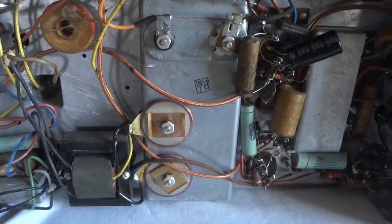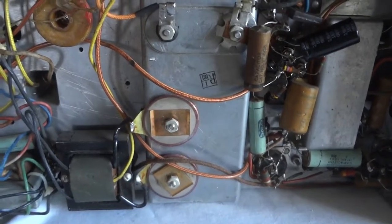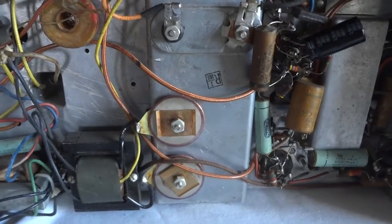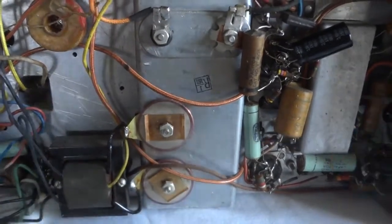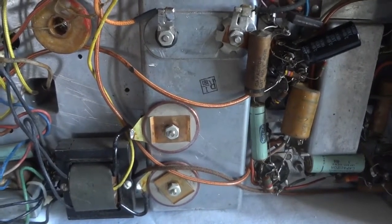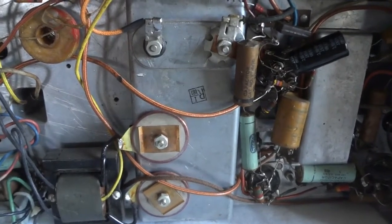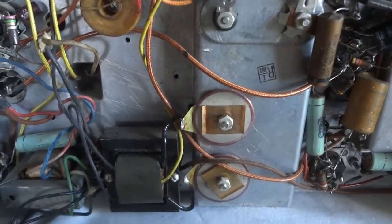This radio needs a 2-volt lead-acid battery. These are very expensive, at least if you get gel cells, because it's obviously not a mass-market product. A wet battery I have not been able to find, but I might buy one of those Cyclone versions — I saw a 2-amp-hour version that you can put in parallel. Pretty expensive, but if you're fixing up radios, you might as well spend the money.